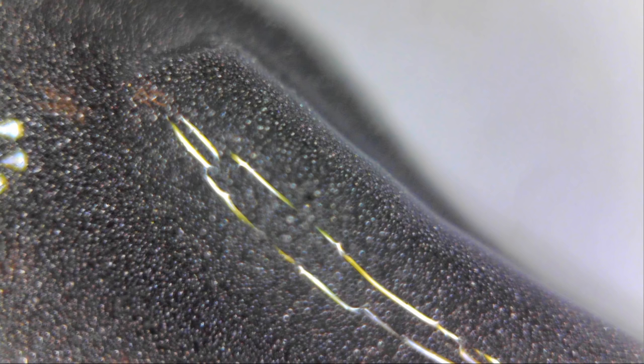However, the lead is really nasty and toxic. You don't want to get it on your skin. You certainly don't want to ingest it. There's no safe amount that you can take into your body and it causes brain damage. So you should treat it with care, which can be rather tricky because it gets everywhere, and when it dries, it's really sticky and nasty and it's nigh on impossible to get it out of your clothes. So I certainly recommend getting some latex gloves. You also need a plan for how you're going to dispose of it safely when you're done with it. So I would say that most of the time it's probably preferable to use lead-free RoHS-compliant paste instead.